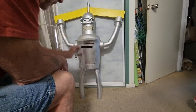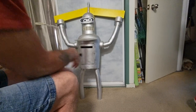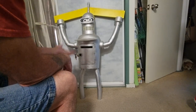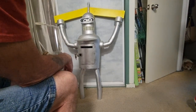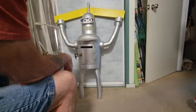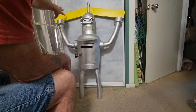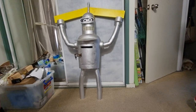I've made a video of how to do this body shape. You can make Bender with straight sides, but that looks a bit boring. If you want the sides to be tapered, follow the video I've put on — that will show you how to lay out a cone shape onto a flat piece of tin or plastic, and then once you cut it out and roll it up, it will make the shape that you want. Check that video out, and also check out the video on the electronics that'll go inside the door. This up here is just a piece of 90 by 20 pine that I've joined together at the top. I've got some 75mm letters that will spell out 'unbendable,' and you'll see that on the attached file that has all the measurements on it.